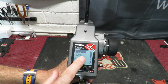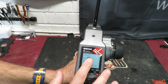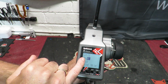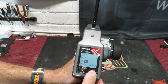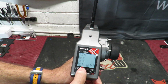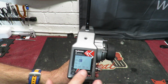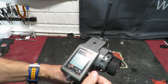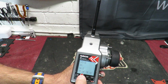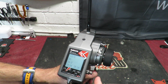And next up, we have one of the potentially most important ones, but seems very unassuming, auxiliary channel. What, Rich? Now on the auxiliary channel, you can define which of the channels carries out which function on here. And you could change channel, for argument's sake, you could change channel 4 to the gyro function. But anyway, let's stick it back on steering. But the important one, I would say, whoa, this is definitely a Richie whoa moment. Because on channel 3, which is the gyro dial on here, if you were to change this function to throttle, that is now acting as cruise control if you had a crawler.